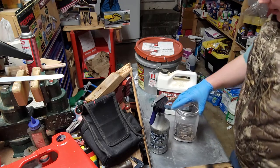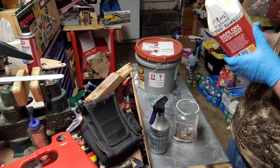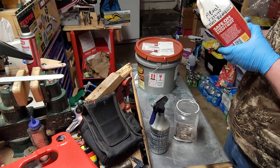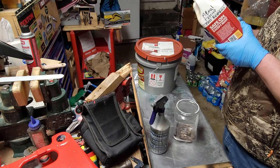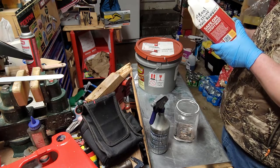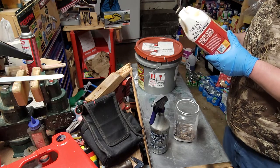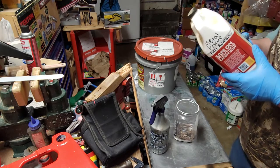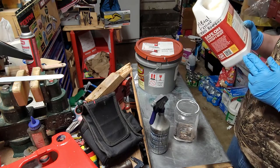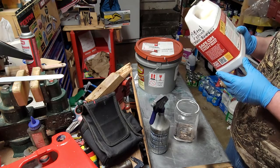So we're going to put Metal Rescue in here, and I'm just going to glance real quick. Light rust, up to 2 hours; moderate rust, up to 8 hours; heavy rust, 24 hours or until rust is removed. Metal may darken in color if not promptly removed from solution once it is de-rusted. That is not a quote; that is me coming up with basically the exact opposite of what their sentence says. It says once de-rusted, promptly remove from the solution or metal may darken in color. So in other words,